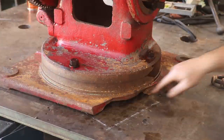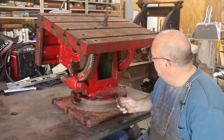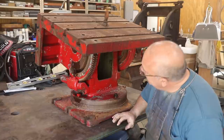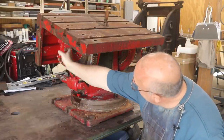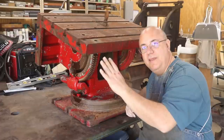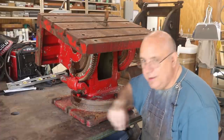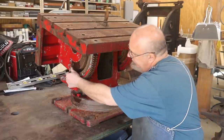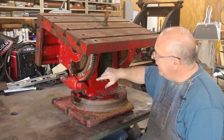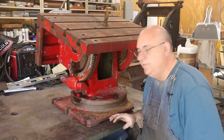Just a quick look here to show you this area down here where we got the broken casting — we're going to talk about how we're going to fix this later on. So let's first take a look at how this thing works so we can kind of get a plan on how it takes apart. The top piece is a separate casting and it pivots — there's a pivot point that goes all the way through there, a rod that goes all the way through the whole casting, and that's what it pivots on. On the side here we've got this worm gear setup that goes out to a little stop in the front. You turn a handle, that turns this worm. You loosen up the bolts on the side on these trunnions and that will allow you to crank it and actually rotate it. And we have a scale in here that tells us approximately what angle it's going to be at.